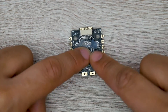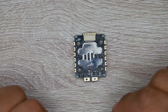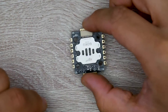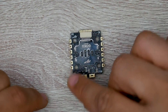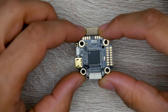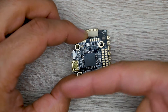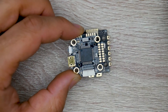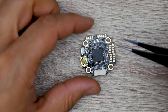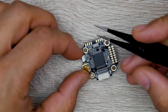If you take a closer look you'll see M1, M2, M3, M4 — this is the motor orientation set up for default Betaflight motor layout: one, two, three, four. That's how the ESC is set up. Your flight controller is set up with the USB on the left, the connector toward the back — they provide a long enough connector for this. The flight controller should be set up so the camera is up front.